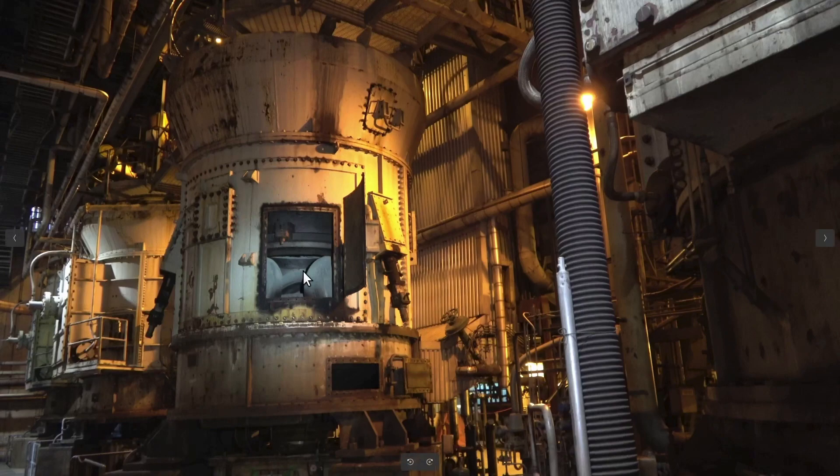These older style mills are really prone to skidding, which means the rollers quit moving and start sliding. That can be detrimental to the thrust rings and do a lot of damage. These have spring tension holding down the ring, and springs up top that put downward tension on the rollers — they can move up and down over rocks. Down here is the air box; here's the air coming in, dropping down a duct coming in here. This is the sweeping steam — steam to blow any coal that gets thrown back up in here out when you shut down. There's also inerting steam that floods the table when you shut down if you have hot coal inside.